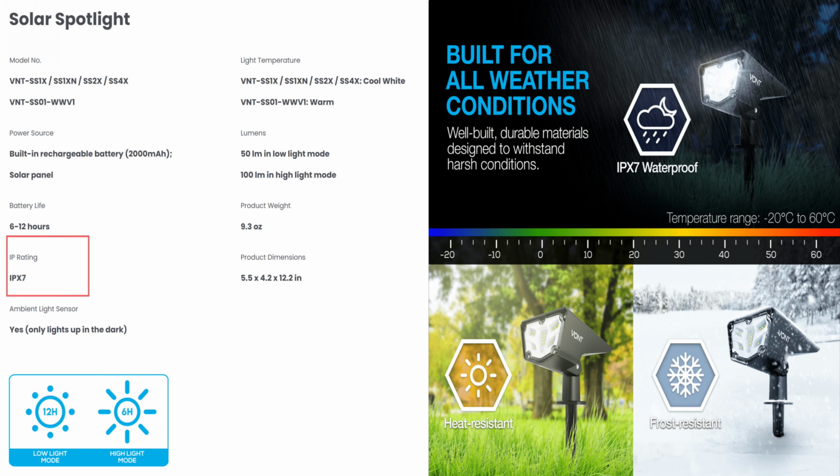These spotlights are built to the IPX7 or Ingress Protection X7 standard, and I'll put a link to the standard in the description below so you can read more about it if you'd like. Basically, the enclosure should protect the internals from water intrusion for a duration of 30 minutes while fully immersed in up to 1 meter of water.